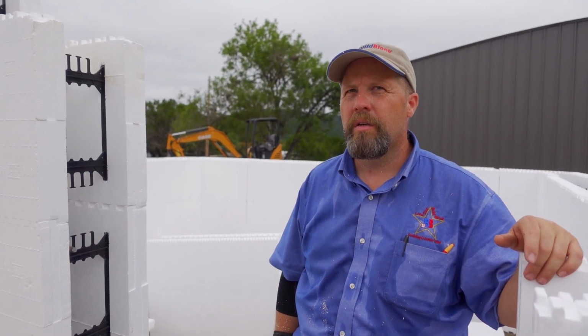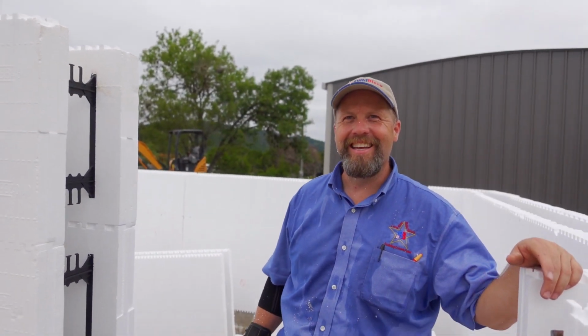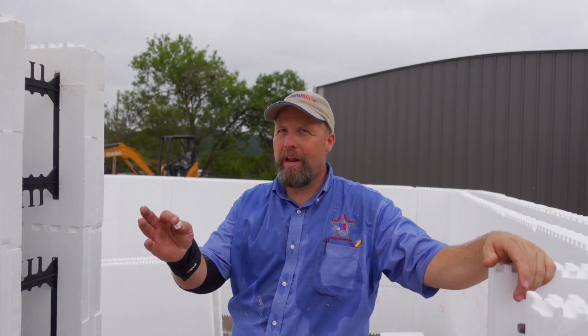Right. Because it also depends on how tall the wall is, right? If the top of the window's at 8 feet and the wall is 12 feet, you have 4 feet. Cover, yeah. We don't do math in our head. Anyway, a 4 foot beam by 6 inches, that's pretty strong. That's a good beam, and you can span a long ways with that.